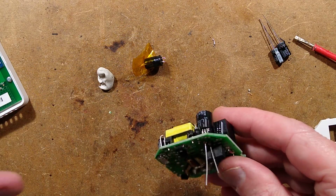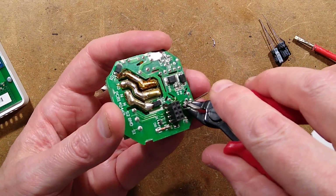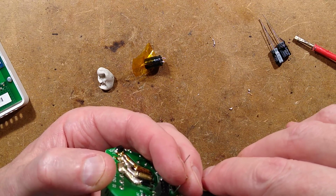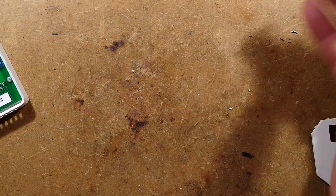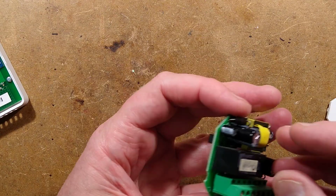I'm saying that it may never ever go back into the enclosure again because I've just put a huge fat capacitor in. On a plus note, the higher voltage rating and the higher mass of the capacitor means that it should do better with the ripple. Do we give this a check? Yes, we do. Where's the mains connection again? And we'll power it up.